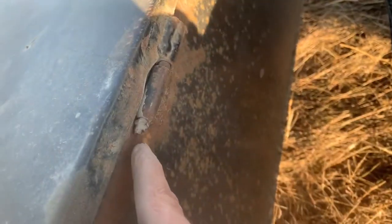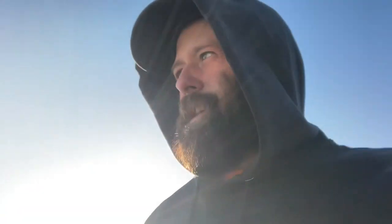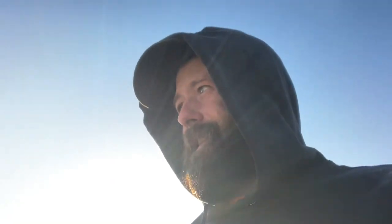Because it's only welded on one side, the weight of the top deck is always pushing down. There are no grease nipples here to grease this up. But they've got a grease nipple on the toolbox and a grease nipple for the jack arm, but they don't have grease nipples on one of the most important parts of the trailer. Now we've got to get it fixed again, and the only thing holding this top deck on right now is the hydraulic cylinder and the pin on the opposite side.